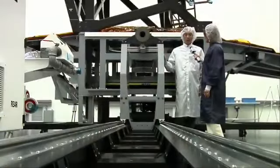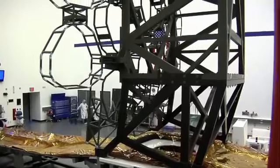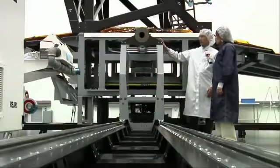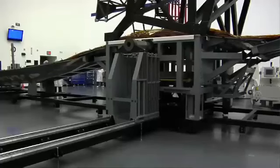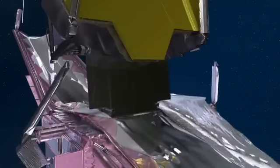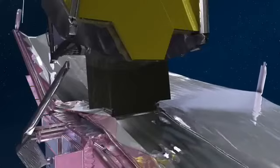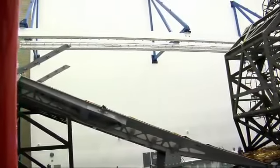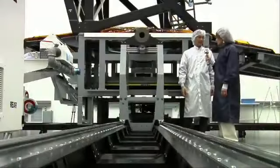We're right next to the spacecraft bus — it's called a bus because it carries the telescope and everything else. This is our mock-up representation of the bus, and we have in it one of our telescopic mid-booms built by Astro Aerospace. This is not flight-like, but it does telescope out to the full flight width. The sunshield will be attached to this mid-boom and be stretched out via a spreader bar on the end — those big gray bars you can see on the forward and aft sides. As the mid-boom pushes out, it'll pull the membranes out and unfold them.